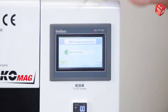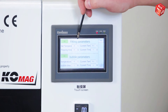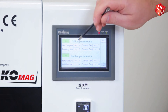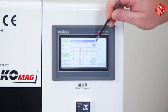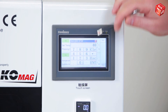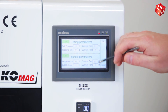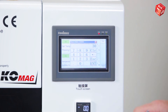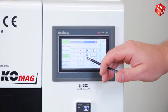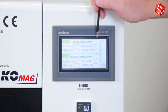Let's go back to the settings menu and tap the preferences button on the bottom right side. The top half of the screen shows the vacuum press info, and on the bottom we can see info about the autoclave. On the top half, you can set the temperature in the top box and set the operating time for the vacuum press in the box below that. Normal operating temperature is from 45 to 60 degrees Celsius, and the press operating time is usually from 30 to 50 seconds. The other two boxes show the current temperature and elapsed time.